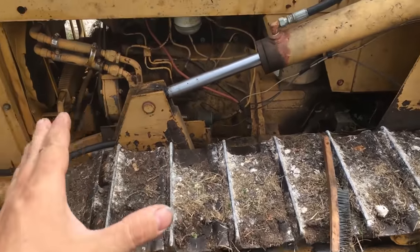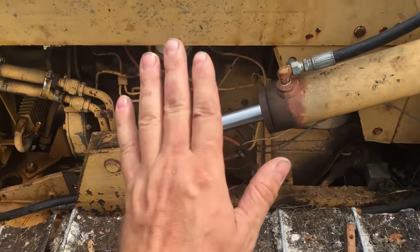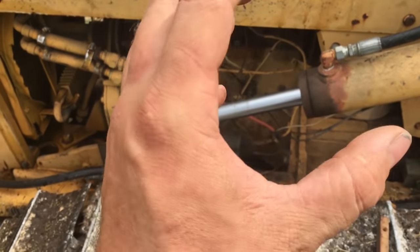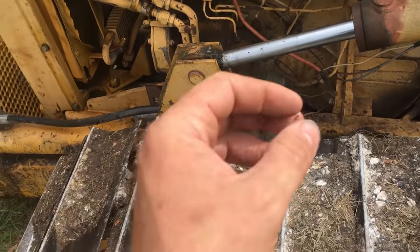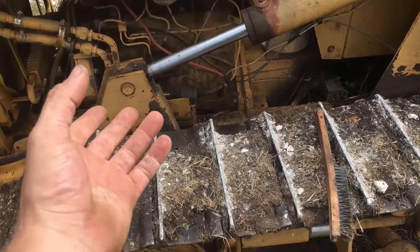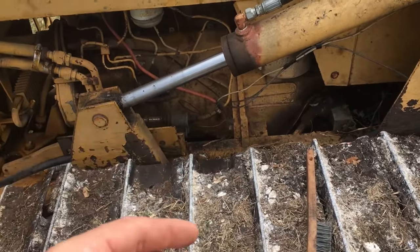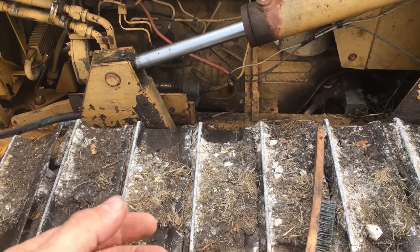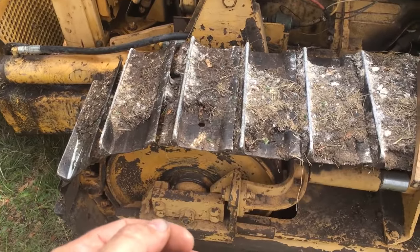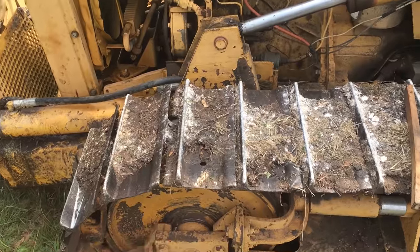Because what happens, you stop the circulation of coolant through the engine, and then the water that's inside the engine just gets hotter and hotter, and if it's over 220-25 degrees, it's going to start boiling, right around the cylinder head. When that happens, you can get some metal that deforms. Now on these old tractors and old engines, where they're all cast iron blocks, cast iron heads, you don't have to worry about it that much because everything was just over engineered and overbuilt. But on new stuff, especially like an aluminum head, anything with aluminum, you get it too hot, everything warps